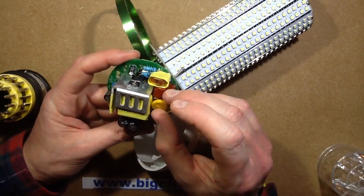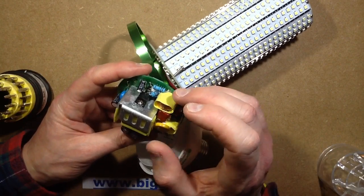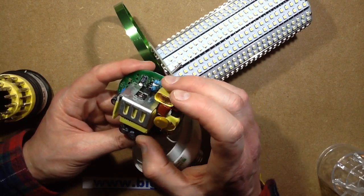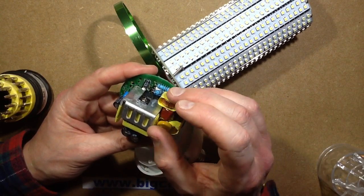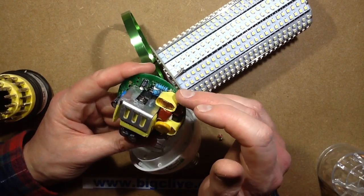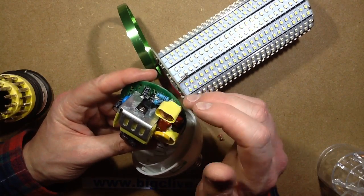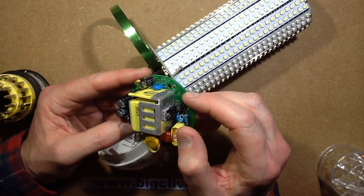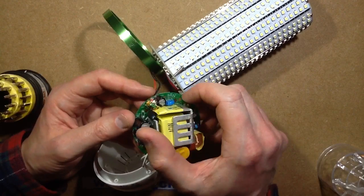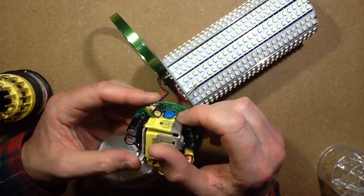There's not much smoothing on the input side, which I think is probably for power factor — to ensure a very good power factor. It's not doing the usual rectify-and-capacitor approach; it's running seemingly on the sine wave, and then all the smoothing is being done in the output, with perhaps a little bit of regulation there as well.